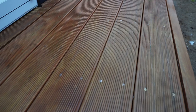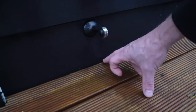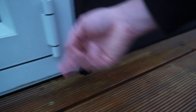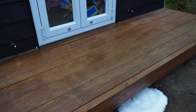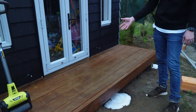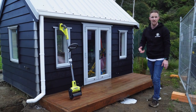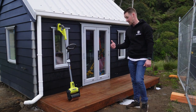So a really good way to strip back the deck. Where I did struggle a little bit — and it's not necessarily a downside of the tool, just the area we're working in — when you get to a tighter area, the tool is too tall to fit under certain sections and it gets a little tight working up against some of the boards and framing. So you will still need to do some hand scrubbing depending on the mechanics of your deck or the area you're working. But really happy with the result — that saved a lot of manual labour. A couple more passes with a heavier chemical should strip all of the stain off a deck like this. Thumbs up in this application.